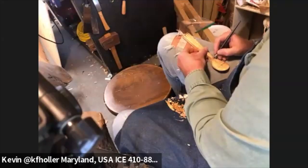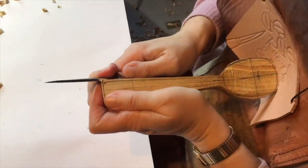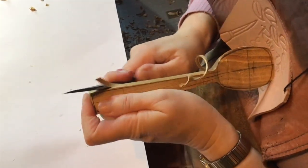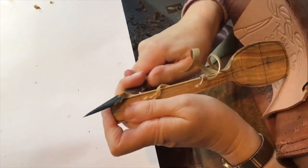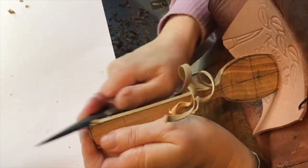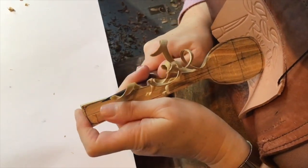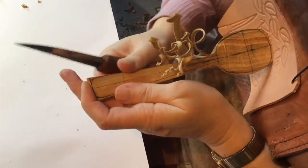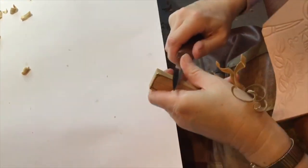What's the order of operations here, Rachel? Down the handle. So exactly the same as we did before. I do the side of the handle that matches my dominant hand first. And would you do that helper chamfer move here? Would you do it in thirds? No, because we've got it nice and thin. That's one of the reasons I take a reasonable amount of material off. I just do it straight as a parallel cut. Mine might not be as thin as yours. I think we measured it, didn't we? We did, but now I'm surprised because that doesn't feel to me like a comfortable amount to do in one. Okay, well, do it in two.